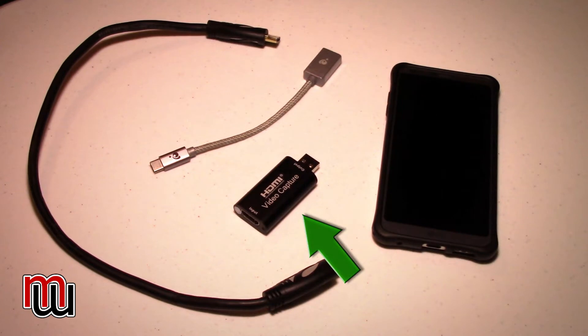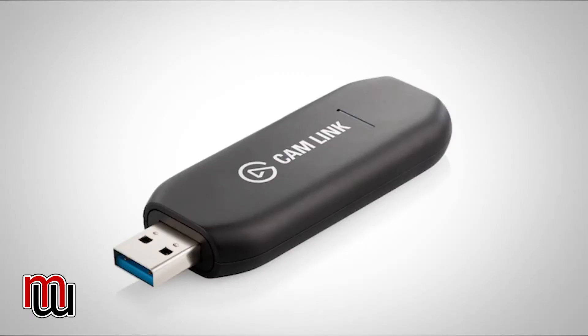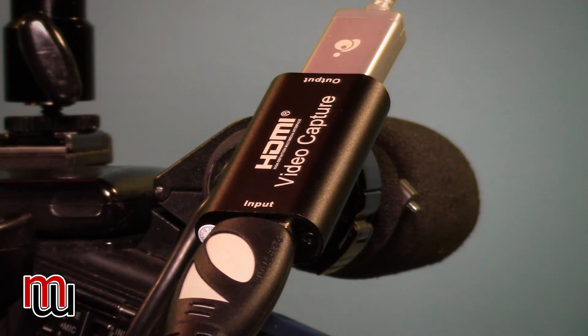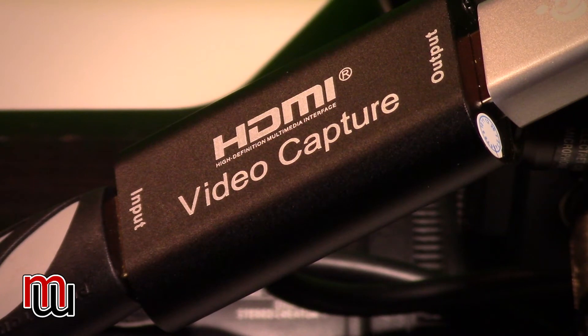The second thing you're going to need is this — called a UVC adapter, or UVC capture card. Not all capture cards are created equal. I have this more expensive Cam Link 4K — it is USB 3.0 and will stream 4K video through OBS software on your laptop. But it will not work for this setup because the phone really can't handle the data speeds and it's just glitchy. What I found was this more generic capture card from China — it doesn't even have a brand name. The link is in the description. I think it was about $45, really cheap, whereas the Cam Link 4K is close to $200.